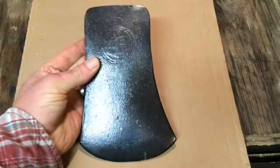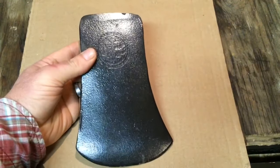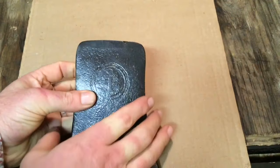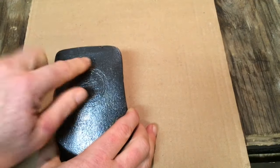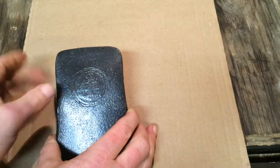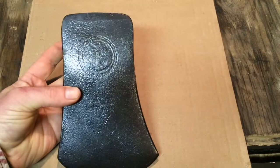Now you may be wondering what I mean by saying I'm going to shine this up — it already looks pretty doggone shiny. The story behind this axe head is, I've already begun fooling with this thing. The first thing I did was, the poll of it was mushroomed out pretty good, so I took a file and cleaned that off. When I did, it exposed nice, shiny, clean metal, but left the rest of it with that patina that comes from the forging process, as well as who knows how many years.